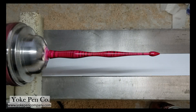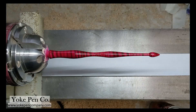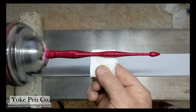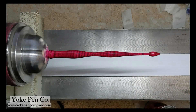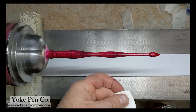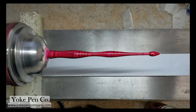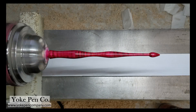There's a lot of work in the preparation of the finish afterwards. I stopped to look at it and decide if I needed more — I always do a couple extra coats just to safeguard so I don't sand through. The wet sanding is coming up next. This is a repetitive part of the process, but bear with us — it will be over shortly.